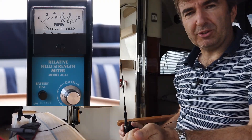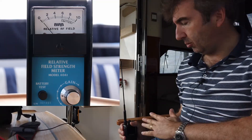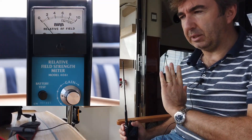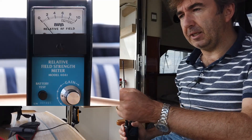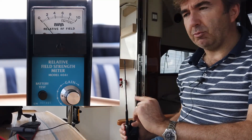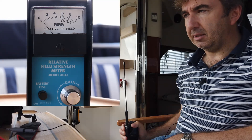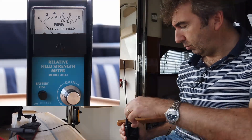Here we are, we're set up. I've got a couple of cameras - one on me so you can see where the radio is, and I'm holding it down here low so I can fit the telescopic in when we test that one. We have to have them all in the same position because a slight movement can affect the field strength. The other camera is straight on the meter. Keying up now with the stock antenna on 7250, medium power - the needle's just barely moving, almost a one on the relative field strength.